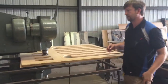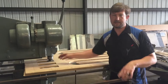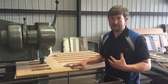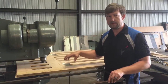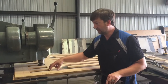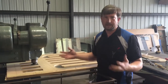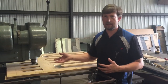I do want to mention that I'm doing the square on top of the die. It actually creates twice the work when you're making your wood buck, because the way I do it is I'll go ahead and cut the oval shape in both pieces at the same time, and then I'll come back and square cut the top piece just so I know that they're aligned correctly. Again, it makes double work, but I like the effect that it has.